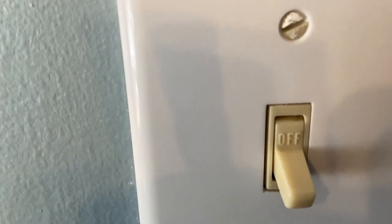If you do not have a GFCI in a wet area, your house does not meet current electrical code — it is mandated. Or at least a GFCI controlling that area: it doesn't have to be in the room, but the room has to be GFCI protected. An easy way to identify a three-way switch is that a standard two-way switch — that turns on and off a single device or a single light — will have the words Off and On written on it. In contrast, three-way switches have nothing written on them; they are smooth. So that is the easiest way to identify three-way switches.